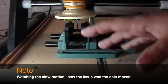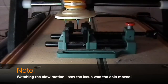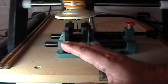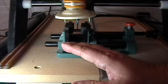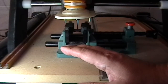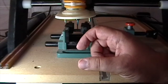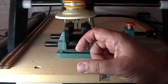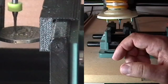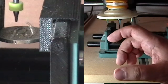You can see how it did that in the frame above. You'll have to experiment with bits, bit types, and feed rate speeds like anything else. One of the things I found with doing these coins is it's hard to gauge the material of the coin to the cutting speed and cutter. That Malaysian 50 cent piece was kind of gummy, and what happened is it grabbed hold of the bit.